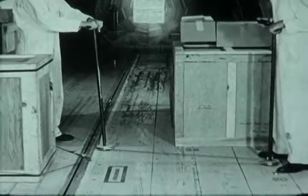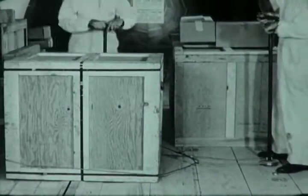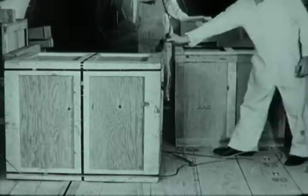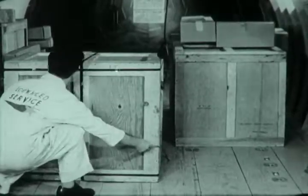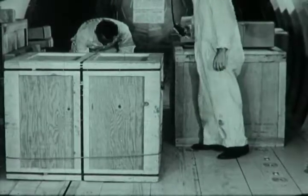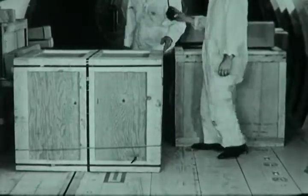In more confined space, two pogo sticks are used in combination. The extra stick in the center keeps the conveyor cable from fouling on the cargo seen at the right. These pogo sticks fit into standard floor fittings and can be placed wherever desired in the cabin floor. Once the box has been moved to cabin center line, a direct pull from the conveyor will move the box to the rear. Once more, only sufficient effort to guide the box need be exerted by the crew.